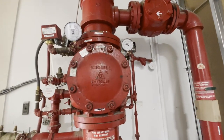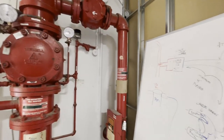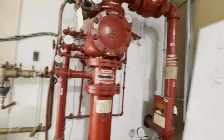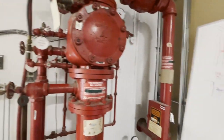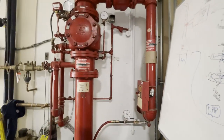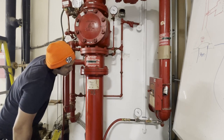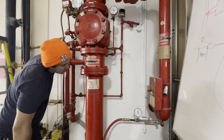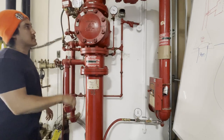If I only had 120 on here and I want to pump this up to 150, eventually that check valve is going to open and I'd actually just be pumping up the entire system as a whole — I don't really want to do that. I kind of picked the lazy method, but you know what they say: give the laziest guy the most difficult task and he'll find the simplest way to do it. I've got a check valve there — we're going to pump that up. There will be some air in there so sometimes you have to pump it up, let it sit for about five minutes, then give it another pump.